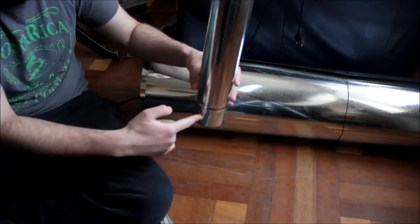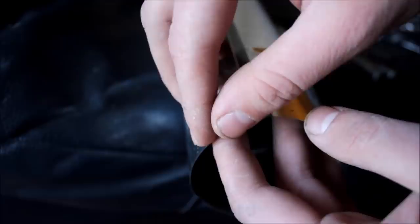Now, in case you are wondering how this pipe is made and you want to save those few dollars, the top side is bent inside from the bottom, as you see, and the bottom side is bent like this, so when the two pieces meet they lock together like this and they don't come undone. Then you take just a punch and punch it, or maybe a nail, it doesn't matter, so that they stay together. And this stopper is not necessary, but you can make it by yourself as well. It is a lot easier to take it to a professional, because they already have the jigs made which bend this, so it is very easy.